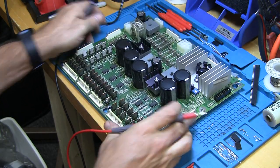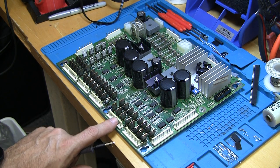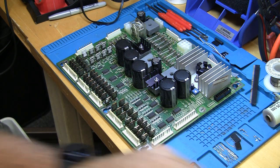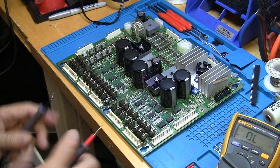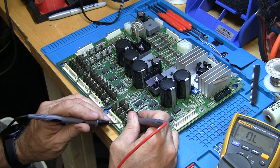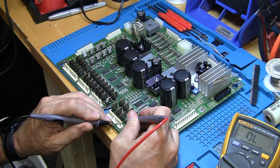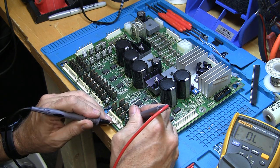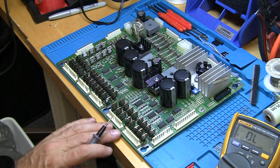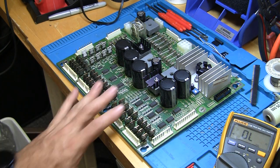This is J7. Pin 1 and pin 3 should correspond. The first thing to check is whether the traces from the transistor to the connector are good — do we have a cracked solder joint? I put the meter on continuity and check the collector and pin 3. That is a good solid connection, so it's unlikely we've got a cracked solder joint. Everything indicates this board is probably okay.